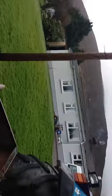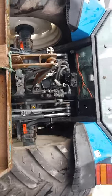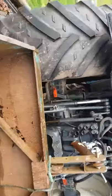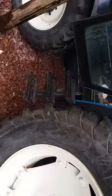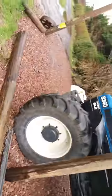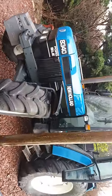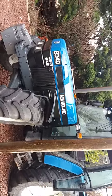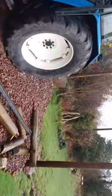This is where your battery is — lift up your step and you get at the battery. We're short on storage today so we're doing this fast. You have your three-point linkage, all your auxiliary spool valves, your PTO — 540 and 1000 — and your pickup hitch. These are a lovely tractor. For four-wheel drive they're an ideal silage tractor or a carting tractor as we call it.